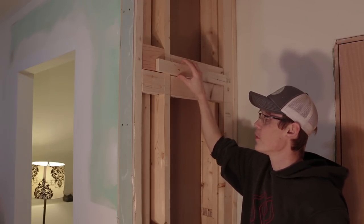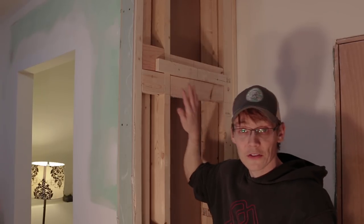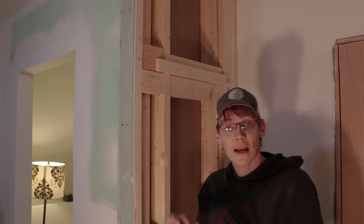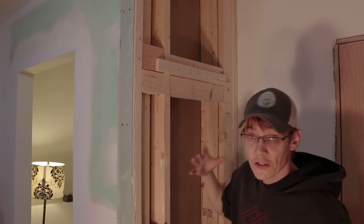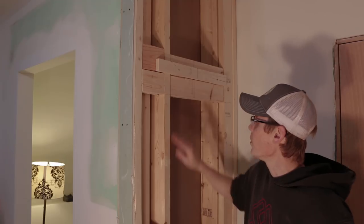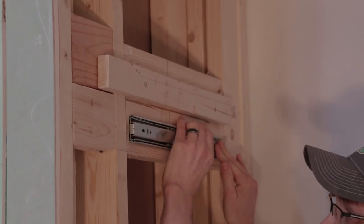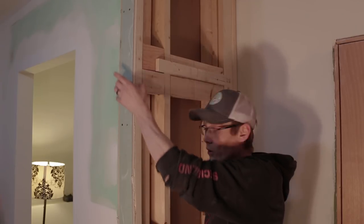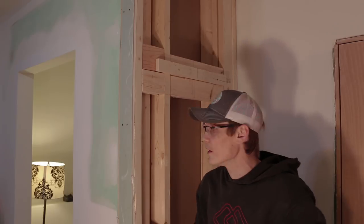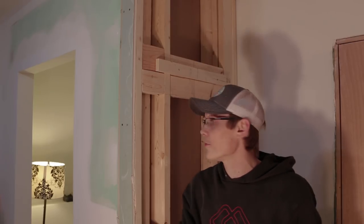You'll also notice I have these boards that I ripped down to just a little under 3/4 of an inch on the table saw, because I still have to hang a half-inch drywall on this wall. These drawer slides sit really low, which is good because we want that mirror as snug to the wall as possible, but there's just a minor bump. We'll also need to put a metal corner piece so the drywall doesn't get dinged up, and do a little drywall mud feathering to blend that in — so we have to account for that height as well.